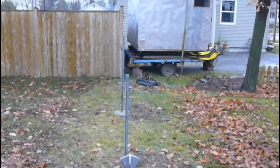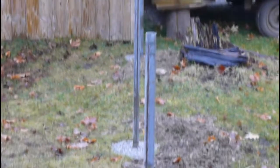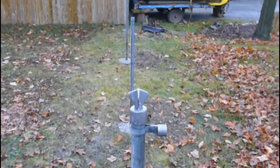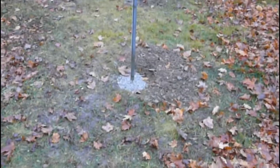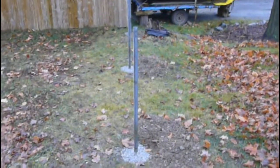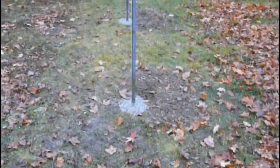See, when you look down at this one pole here — it's just off a little bit. It's not off as much as it looks like on camera, but basically what I did: I had my lines strung up, and this was the first post I did. It was dark and I was trying to get it all done because it was going to rain the next day. What I ended up doing is putting this post on the wrong side of the line — all the other posts were on the other side of the line — so this one is off by about one post width. It's not going to be a big deal since I'm not doing this for aesthetics, just to keep my dog in. But to teach you a lesson: make sure all your posts are on one side of the line or the other. This way they'll all be even.